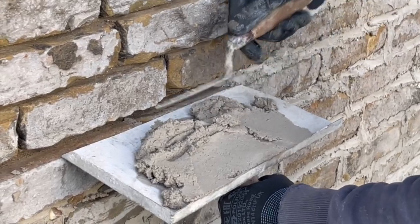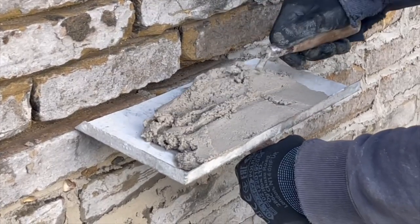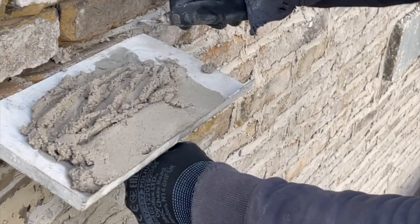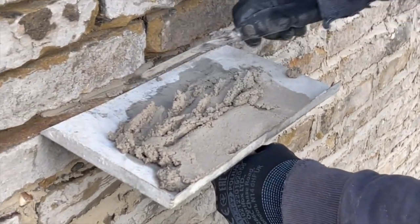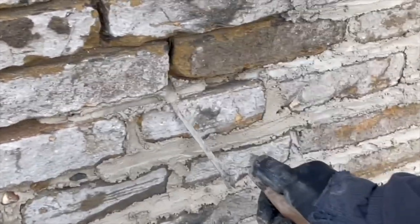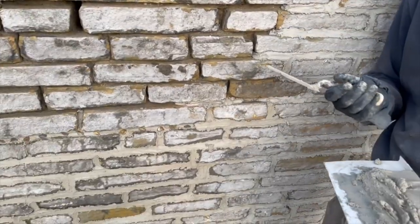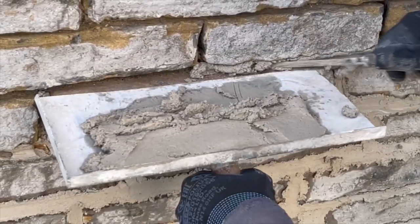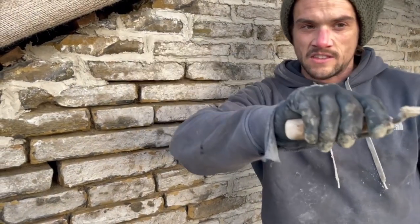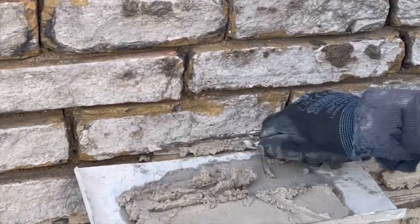This mortar is probably a little bit too wet for pointing - this consistency is more for laying block. It wants to be nice and creamy. We're working it to an even consistency and then pointing it to the back of the joints, working our way along. When we get to the perps - the verticals - we just press the mortar in. Any water that gets in sheds straight off out of the joint rather than sitting in there getting through into the cavity. I'm using the top edge of the trowel to work the top of the joint, then on the second pass I twist it down and work it right in using the bottom of the trowel.